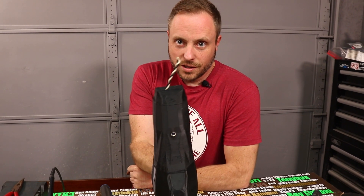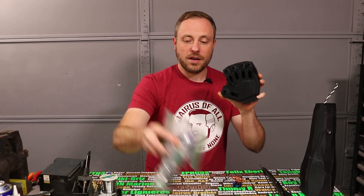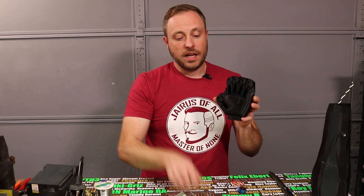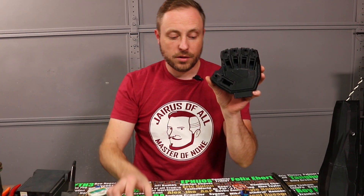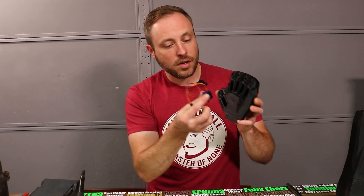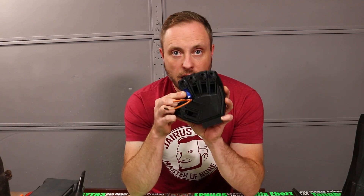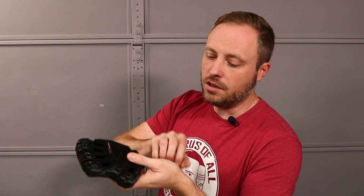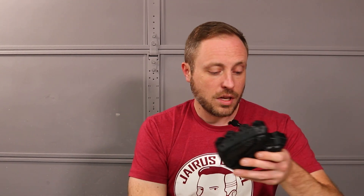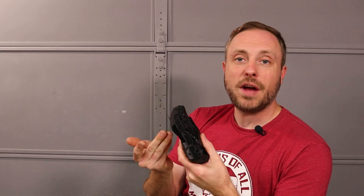Those two wires go to the part that's really cool — here's the hand. I have all of my finger pieces organized in bags. They're gonna be held together by strips of spring steel, and that spring steel will be locked in place with little grub screws that I have holes modeled for. Then string will be threaded through everything and pulled on by servos, and that will make the fingers do scratchy motions. Most robotic hands have positive control in both directions, but there's an easier, simpler way: the servos just close the fingers and rely on the spring steel to make them spring back open.